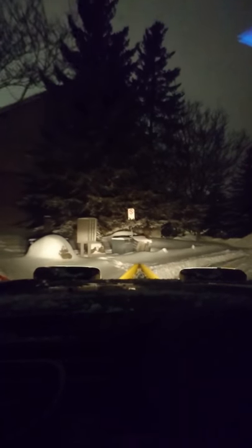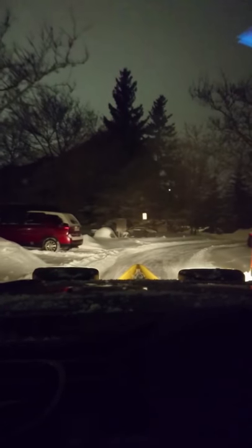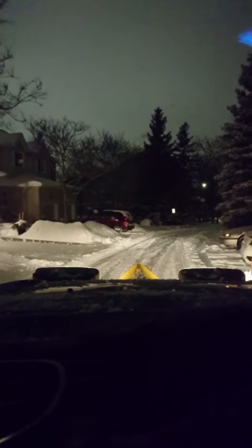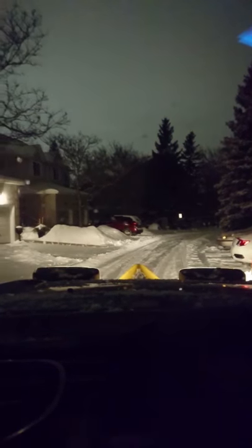And then it helps with the style of plow too, because the angle of the wing when you're going down a curb does a really good job of peeling the snow away from the curb rather than kind of building up and letting it spew over. But yeah, so you start in the middle and just make a few passes in. Just work your way in.